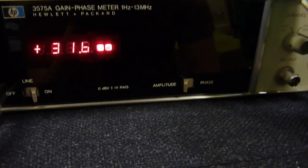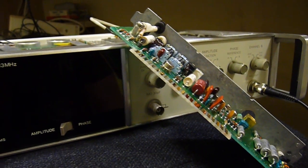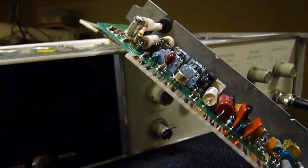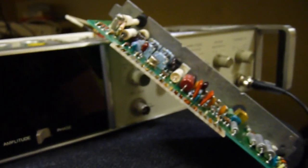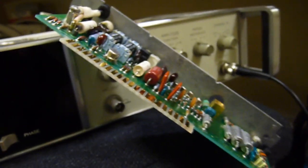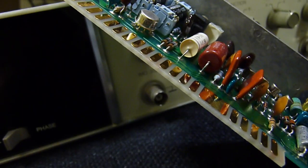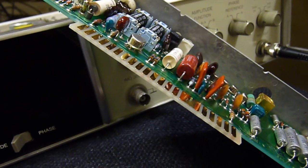This thing is fully recoverable somehow. I've just got to figure out what's broken on that board. I did find the coil though. I was doing the multimeter and continuity. I'm going to see if I can find a data sheet for those relays, so I can get an idea of exactly their pinout, what should be connected when there's power and what shouldn't be connected, their voltage, because none of that seems to be marked on them, or at least in the form that I understand, because we are talking about a circuit board which is a little over 30 years old. So yeah, things were done a little differently back then.